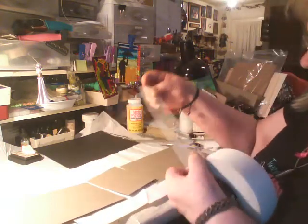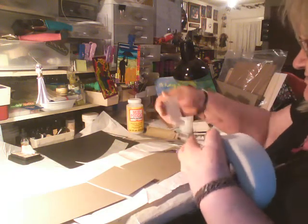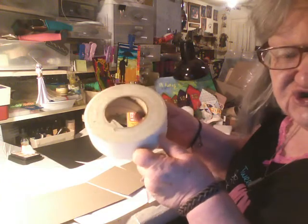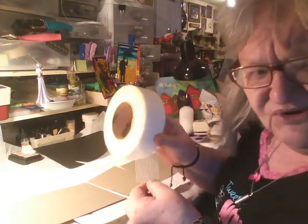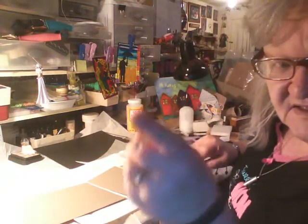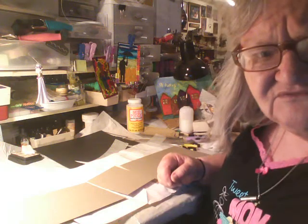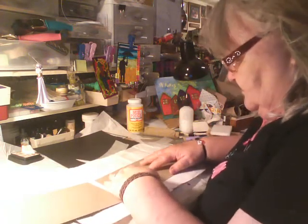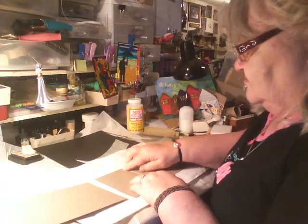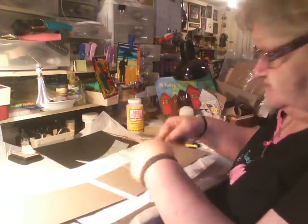So what I'm going to do is take two pieces of that — I've got one there and one there. They're a little bit long but I'll trim them. It's some kind of polyurethane, plasticky, rubbery — something like that. That stuff works good. Some people put Tyvek on there, but it's hard to find and when you do find it, it's expensive. So I don't use the Tyvek. This stuff's already glued. I make my space about a little more than an eighth of an inch between the pieces.